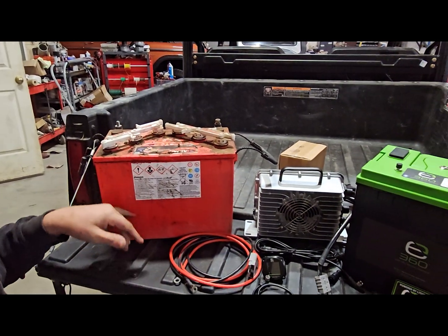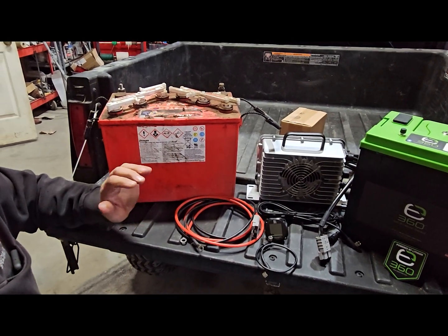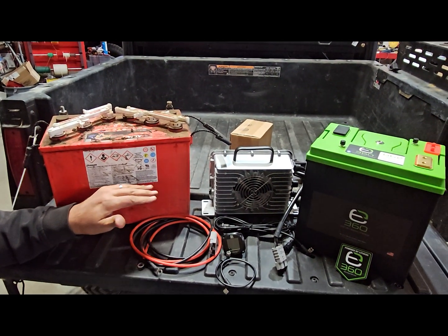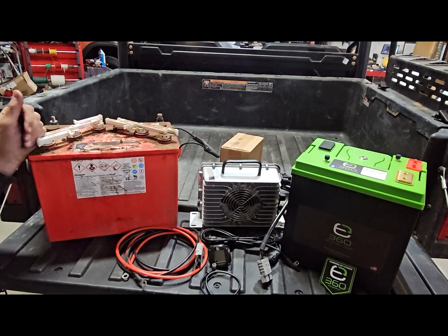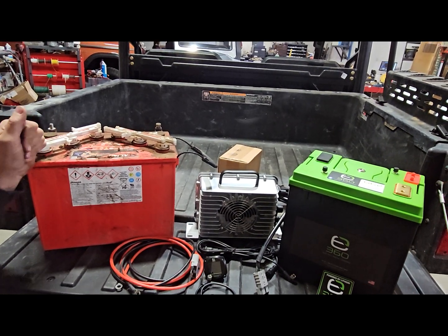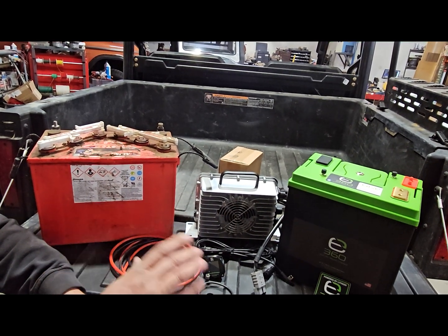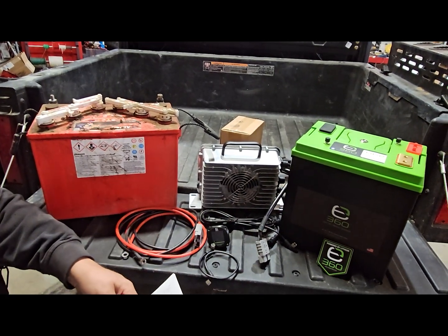Now I know what you're saying — 216 is not more than 310. But it is, because with lead-acid batteries the general rule of thumb is you can only pull about 50% of the rated capacity out of them. You can pull more, but for longevity the battery will die if you pull it all out. So we're really only looking at 155 total usable amp hours from the lead-acid setup, versus 216 total amp hours with lithium — because unlike lead-acid, you can run lithium clear to dead and it doesn't matter, because the BMS shuts it off when you get too low.